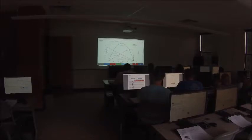Okay, so this creates what we call counter electromotive force. Okay? You've got current going this way, and you've got current wanting to go the other way. It's generating what's called back EMF, back electromotive force. And as it turns out, the voltage that you generate when you're turning, in this case a brushed DC motor, is proportional to the speed. Okay, so for a particular motor, if I'm running at some speed and generating 1 volt, right, if I double the speed, I'll generate 2 volts. If I double the speed again, I'll generate 4 volts. If I, you know, triple the speed, I'll generate 12 volts. You know, if I double the speed above that, I'll generate 24 volts, okay?